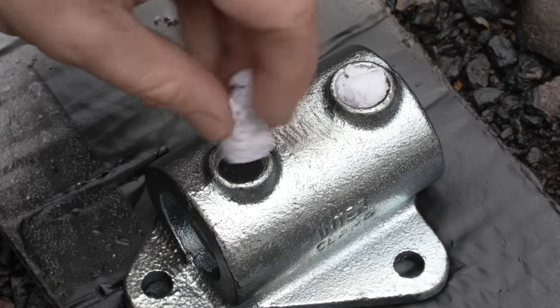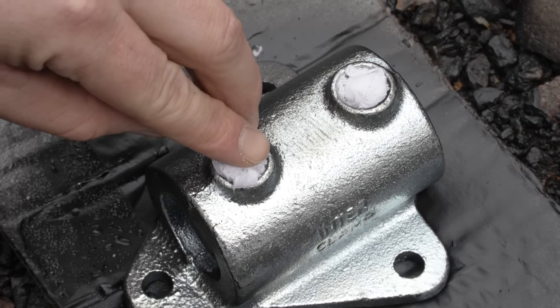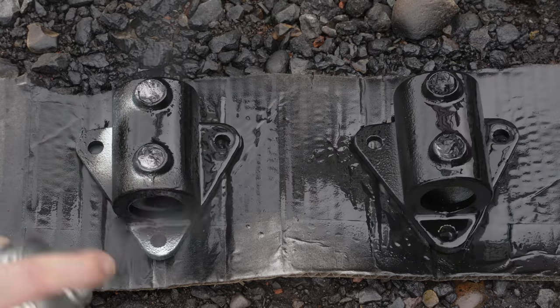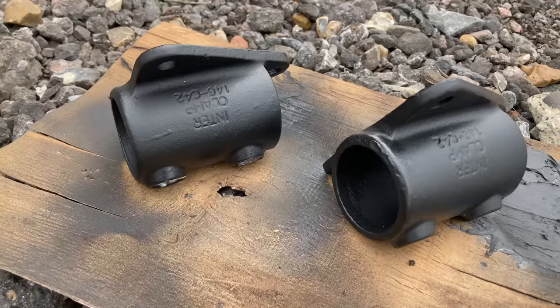I've plucked out this fine pair of heavy-duty vertical mounting clamps first. They are well galvanised, but to fit Alan's aesthetic, we're going back to black with a primer laced with lots of zinc. I stuff tissue into the holes to avoid gooing up the threads with paint. This matte finish isn't the final look, but will do for now.